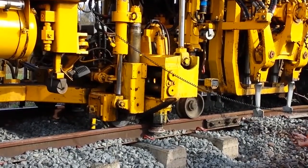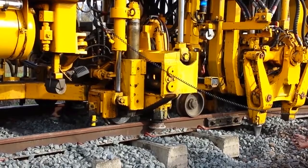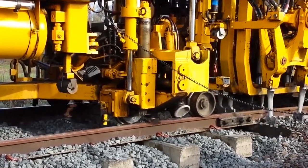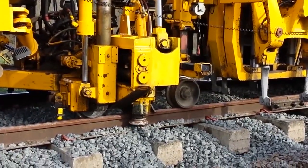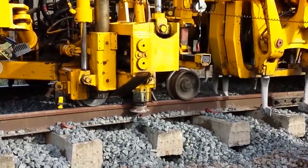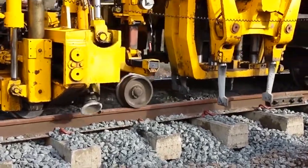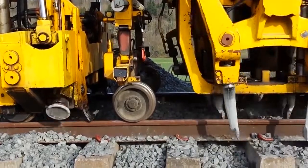These are like several jackhammers tamping the rocks down into place to tighten the foundation. The rail and ties will settle. It also makes level adjustments on the rail, because as the ballast moves around it keeps changing. The process is similar to stomping dirt around a post put into a hole. Ballast rock cars are opened at the bottom and rocks fill up the loose spots that are then tamped down again.